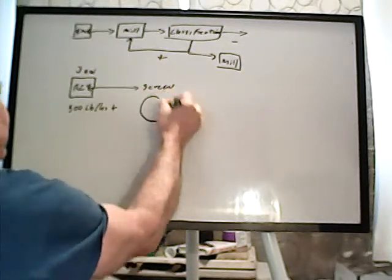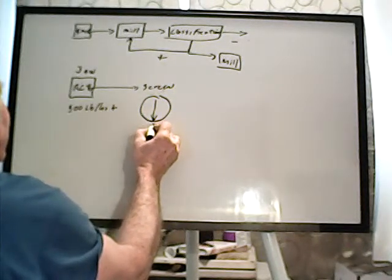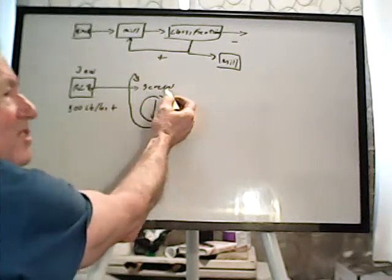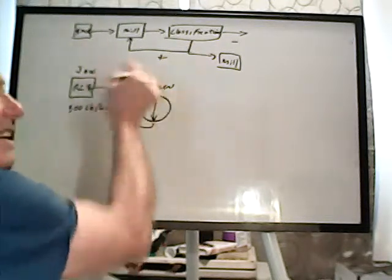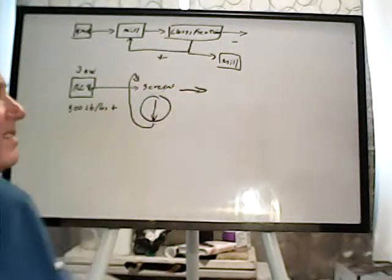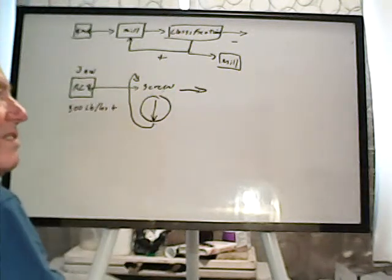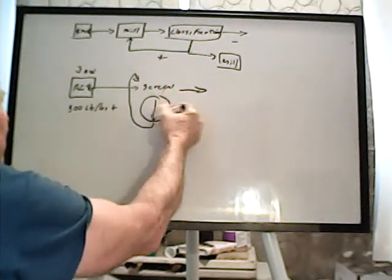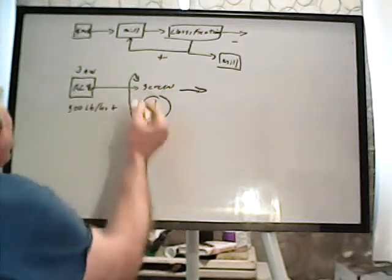And we have the Stutenroth. And I just recirculate all the output back to the feed hopper because it's going to get screened again. True. And that way, first of all, anything that's already fine enough never goes through the Stutenroth. It just bypasses it, minimizing the overgrind, minimizing those slimes. Then as it comes through here, again, you get one lick at the Stutenroth, and then it'll get screened.